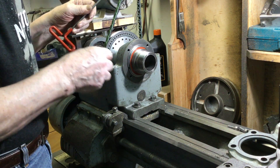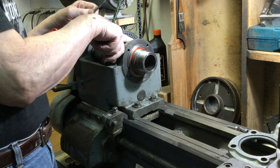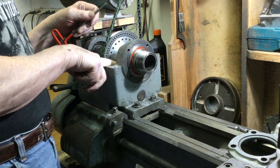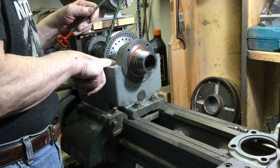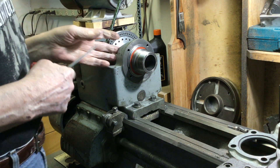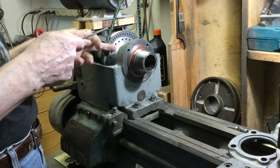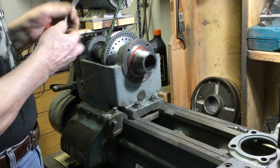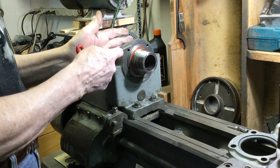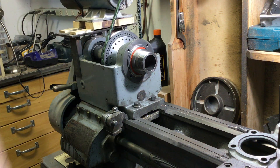So that's the plan at this point. I'll drill holes in the back here and tap them — probably quarter inch, maybe five sixteenths — and make a ring that I can then bolt onto the back of this casting that extends down into the cylindrical bearing opening. That will hold a spacer in there that will push against the bearing and apply tension to the spindle. So that's the plan for now.